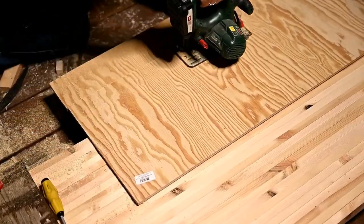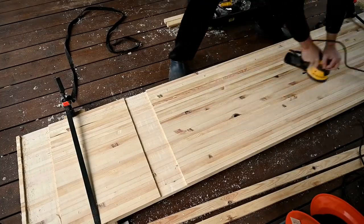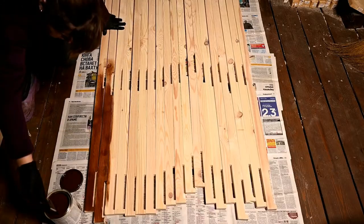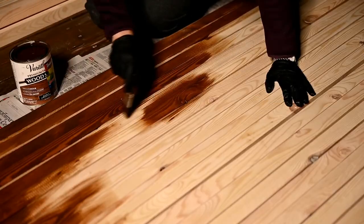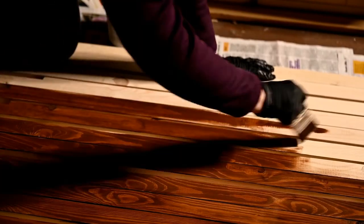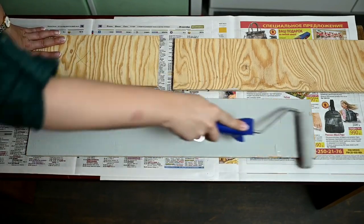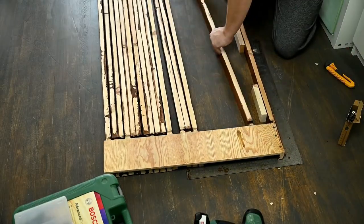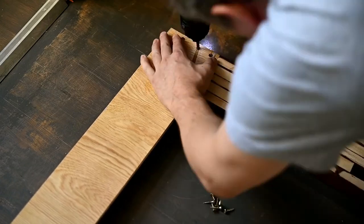Harry cut three pieces of plywood for making the cross parts, keeping them as thin as possible. After that a good sanding is required. Then it's my turn again — I'm staining the slats using Varathane oil stain in Early American hue, choosing the color closest to the countertop oil color. For the cross parts, I'm painting them the same color I used for the walls. After that Harry is assembling everything — placing the slats face down, putting the cross parts into the grooves, and screwing them together.